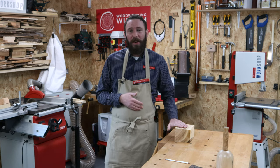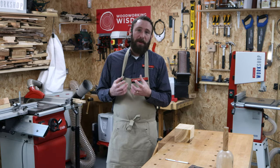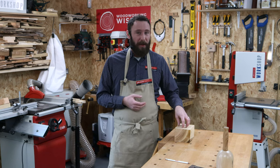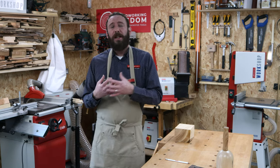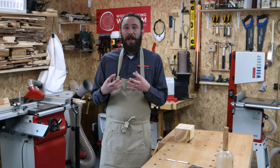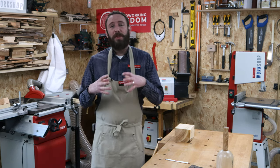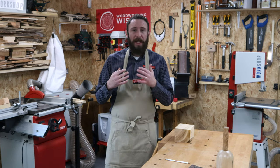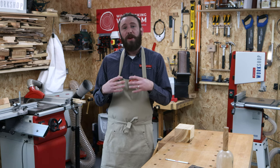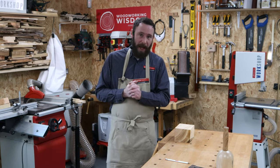We've got a little bit of cherry for this one. They're usually made from birch, but I haven't got any birch here. And this cherry is still a bit wet, so there is something we need to do at the end of the process where you boil the cup. That will take out a lot of the moisture that's in the cherry. Then we're just waiting for that water to dry, because that boiling action will drive out the sap of the cup and replace it with water, which dries a lot quicker. But we'll explain a bit more about that at the end.